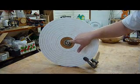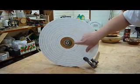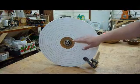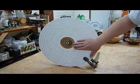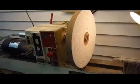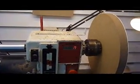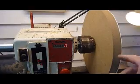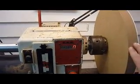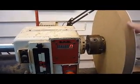You'll also note that the bearing is not set flush or below the surface — it's actually raised up just a little bit. That's because this is epoxied into place, and I didn't want the epoxy to spill over onto the bearing; I wanted it to just stay around the ridges here. So here it is mounted to the lathe. There was a recess turned into the backside of the MDF for my chuck — I put the jaws of the chuck inside and expand it outward to hold this thing on. The lamp rod is running straight through the headstock.